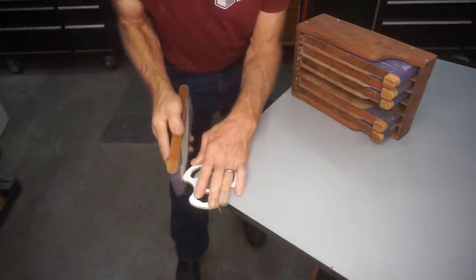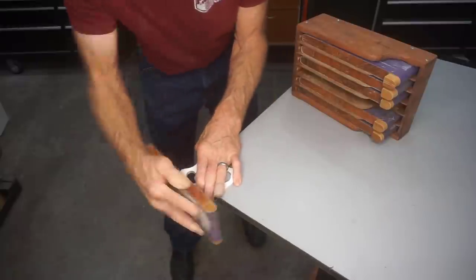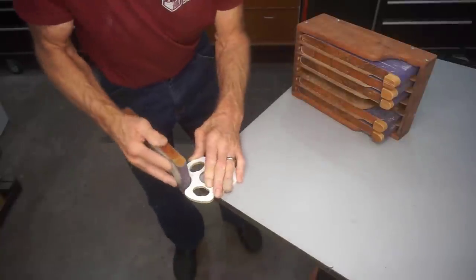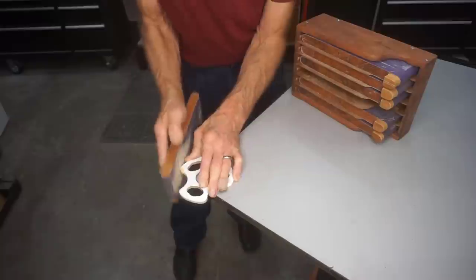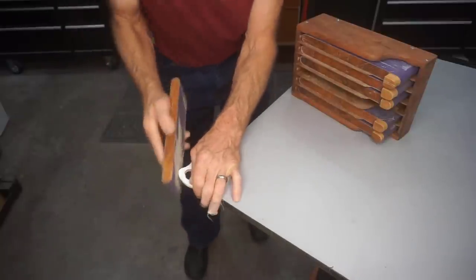After fixing that fracas, I use an 80-grit sanding block to fair these curves and establish the outer contour of the caddy template. A sharp 80-grit belt on this block is coarse enough to make quick work of the job but not so coarse as to tear up the backside of the template. I focus to keep the edges square to the face and keep sanding until about half of the pencil line is gone, which gives a nice, smooth, consistent shape to the outside of the template.